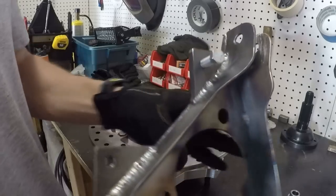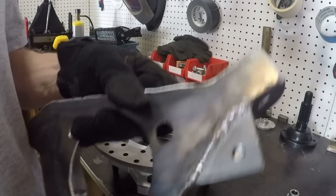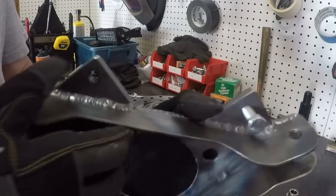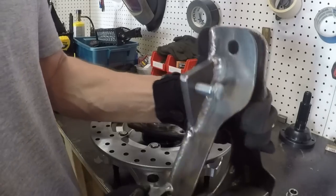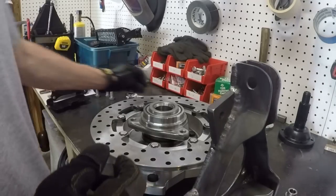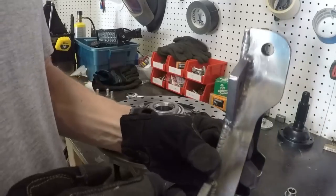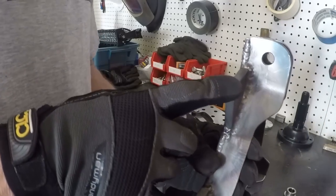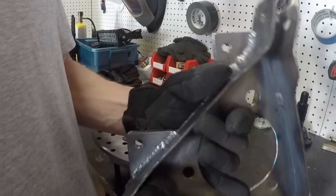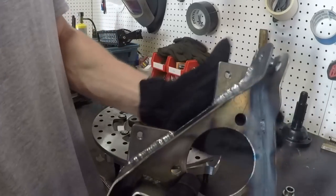There's no nut that goes on the backside, because the backside here is only maybe 1/4 inch off the rotor of the micro stub. So there was no room to have a nut back there, which is fine. So I ended up making this out of 3/8 steel so that I've got plenty of surface for the 3/8 by 24 bolt to thread and tap into. The other reason that I made this out of 3/8 is the caliper is mounting to this, and it has to be extremely strong, because if I lock up the brakes, all of that torque is going to come through these two tabs. So I wanted them to be more than just eighth inch so that there was no risk of them twisting or anything like that.